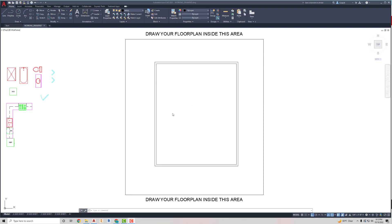The first one I'm going to do is draw the interior wall that goes through the middle. If you look on the dimension page, it's 18 feet 4 inches — that's what I need to offset this bottom line. I'm going to go up to my offset tool. It's going to ask for the offset distance, so I'm going to type in 18 feet dash 4 inches — notice how I type that in, 18 feet, the dash, and then 4 inches.